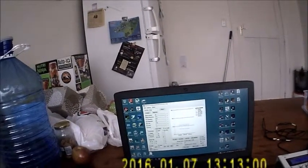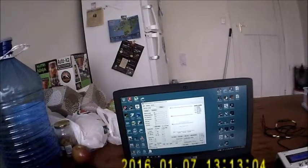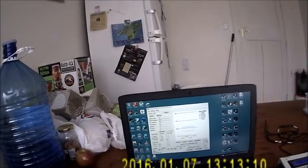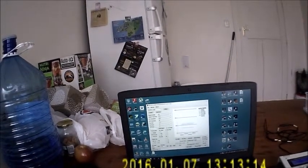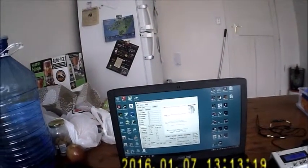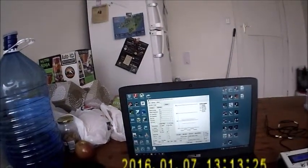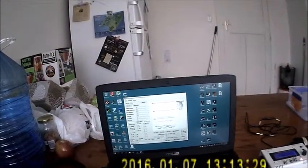So just coming back to the AT bias, this is a value which is applied to the ambient temperature. So at the moment it's subtracting -1 to make this 21.5. So the real value is actually 22.5. And so that's a means of calibrating the ambient temperature. This offset here allows you to adjust where the DewController switches on and off for the algorithms associated with ambient, dew point and midpoint. So I was a little bit confused there.